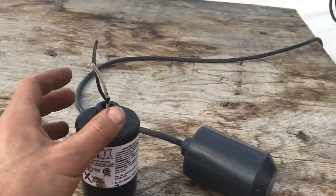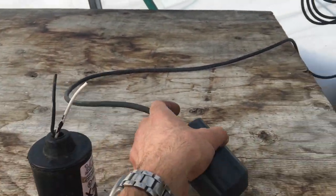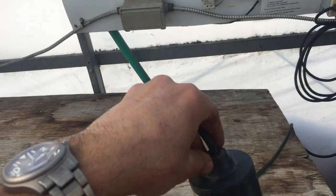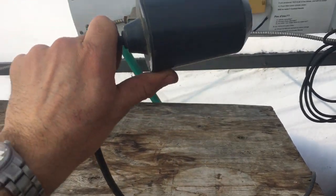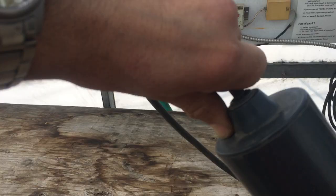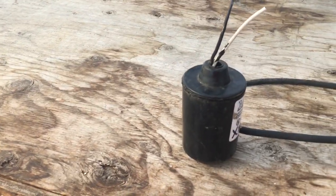So the pump is slaved to a float switch, so that once the float switch tips from vertical to dipping inside the tank, so it's suspended, that prevents the pump from running. And when this thing tips, you can maybe even hear it. So there's obviously something in there, and the old one died.